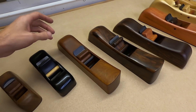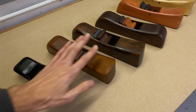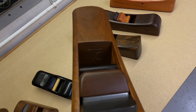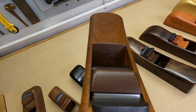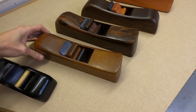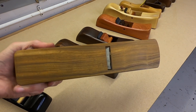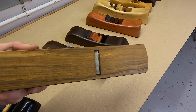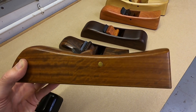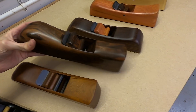This one I made when I was working at Senior and Carmichael — I just made it because I really liked the wood. It's kingwood, and I also got into letter carving at that time, so if you can see there, there are my initials TC carved in. Once I came back from the States, the more commonly used wood here for plane soles is Lignum Vitae — a very oily wood, great for the soles of planes. I used a brass pin through there, going through the rosewood beam.